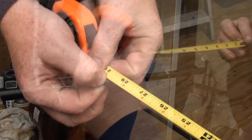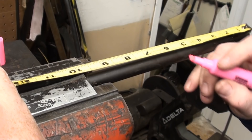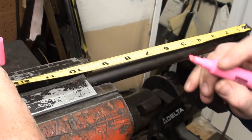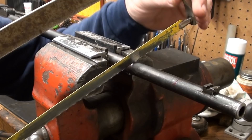We determined we're going to have to take off approximately 6 and a half inches of this barrel to get it to the length that we want. I'm going to get a marking pin and we're going to go a little shy of the 6 and a half inch mark because we're going to do this with a combination of tools — something that you don't have to have a lathe to do. That's what we're going to be demonstrating today. One of the tools used, most everybody should have this: a standard hacksaw.